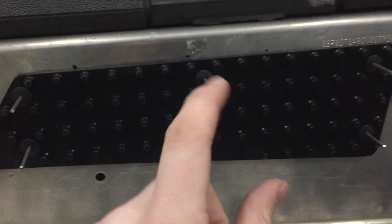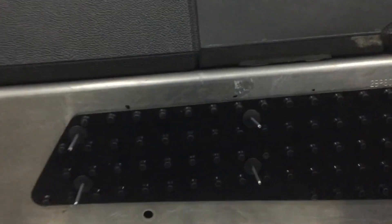I've got it sitting where I want it — make sure all the rivets line up and push them in by hand to make sure they all fit. Then hit them with either a hand riveter or an air riveter if you're lucky enough to have one. Start from the inside and work outward both ways — center, then outside — so nothing moves around.